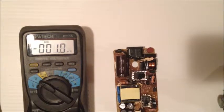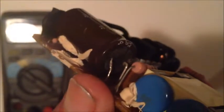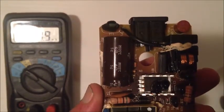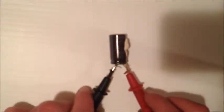We can see there is exactly zero volts across the filter capacitor. I would have expected some voltage still left across it, so what I'm thinking is that it may actually be shorted. I did notice, just as I was taking it out of the box, there does seem to be a bit of damage to the main filter capacitor when I zoom in on it. I suspect this filter capacitor is shorted, so I'm going to take it off the board and test it off the board — and it is certainly shorted.